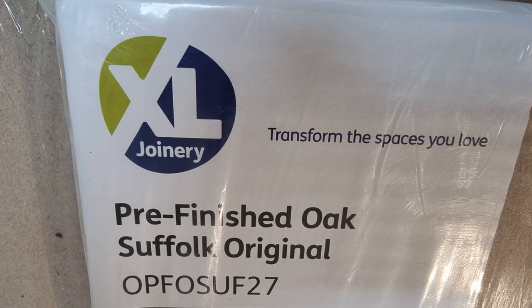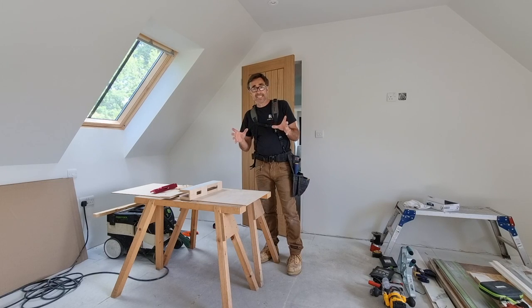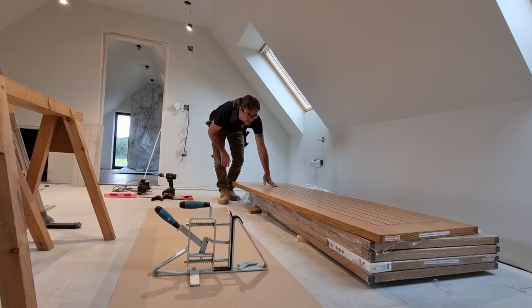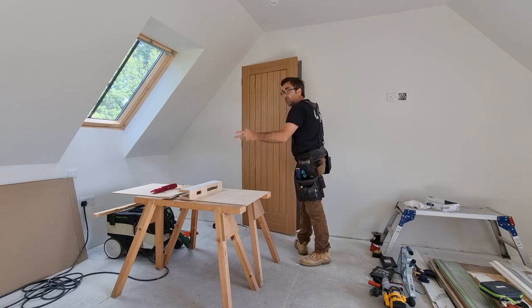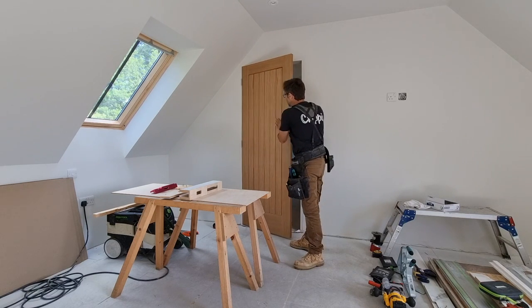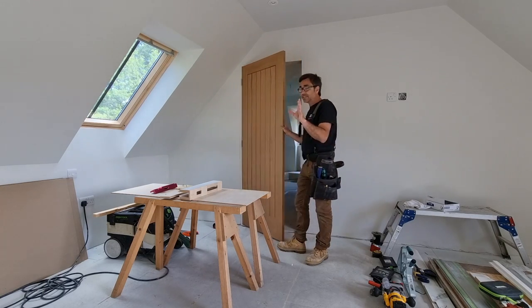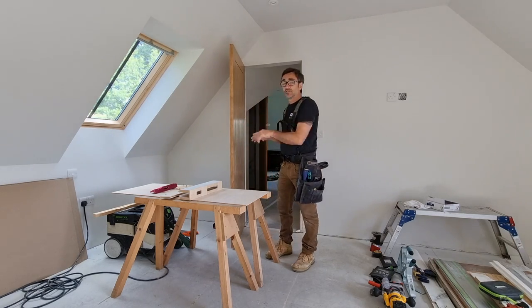Here are the doors — I'm using XL Joinery doors. They're very reliable. These are pre-finished in oak. A lot of doors come pre-finished, some even pre-painted, which means when you're handling them right from the beginning, when you unwrap them from your level flat pile, check them over before you even hang them. Make sure there's no damage or defects. If you've got a few in a room, look at the colors and match them, because being a natural material they will vary in color from veneer to veneer.